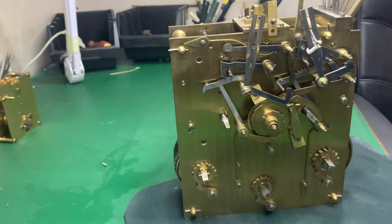The case on the clock needs a little bit of restoration — a bit of the bead has come away. It's not a matter of just sticking it on with glue; you've got to remove all the old glue carefully because you're dealing with a polished case and we don't want to take anything away from it. We don't want to have to repolish the case — we want to put the stuff back and leave it pretty much as it's always been. The dial also needs resilvering; it's only a small dial so that's not a great deal of trouble.